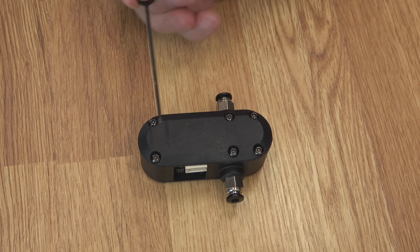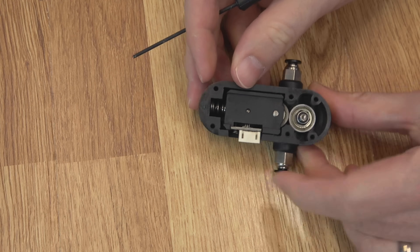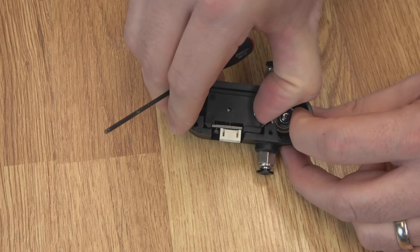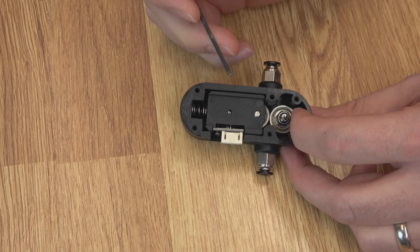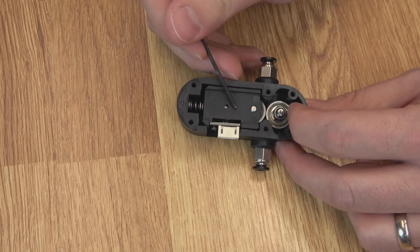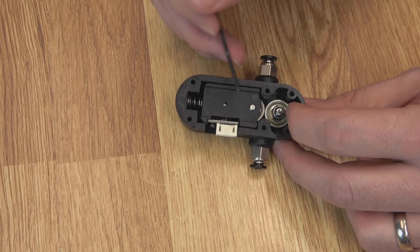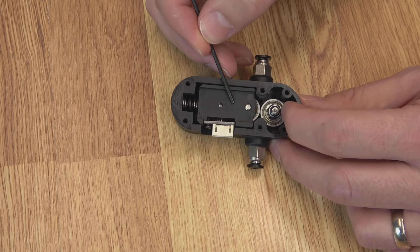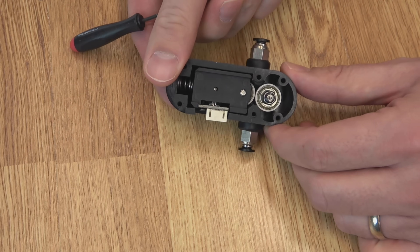What we're most interested in is what's inside and how this thing works. Inside the housing, there are a couple of bearings. The filament passes through these two bearings — one is spring-loaded against the housing to press up against the filament. Inside, you have an encoder that is turned by this bearing. That's how it tells if the filament has run out or if you're starting to get a jam. If the encoder doesn't detect 7mm of filament movement, that's the trigger threshold — it will stop the print. So not only is this good for filament runout, but if the spool gets hung up or the filament breaks, this should save you as well.